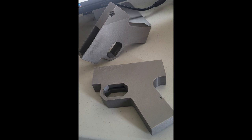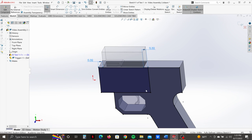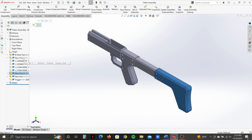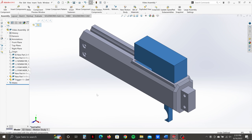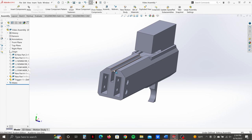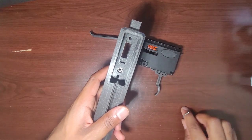The trigger housing was first developed from the templates I mentioned earlier. After finding the best position for the trigger mechanism, I cut out the grip portion of the template to aid in the development of the trigger housing. Unlike the other components, the trigger housing is more complex because it serves multiple purposes. The trigger housing not only houses the trigger but is also the first part of my flight groove. Inside the trigger housing is a quarter-inch hex counterbore socket that must receive a machine screw nut before assembling the trigger mechanism to the housing — if you don't add a nut to the internal hex socket first, the housing will not mate properly with the grip.